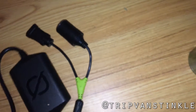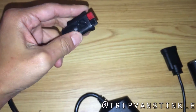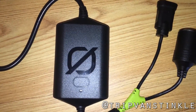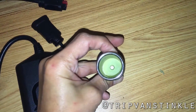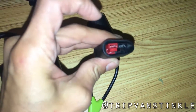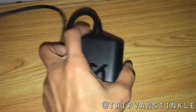Why would you need this? Well, if you intend to run any 12-volt refrigerator straight off of your battery, you're going to run into some issues because Goal Zero's 12-volt output is not regulated, which means the voltage isn't consistent. If you want to run a fridge off DC power reliably, you need to buy this accessory. This includes any 12-volt item — fridge, CPAP machine — these are not things you want to risk shutting off in the middle of the night.